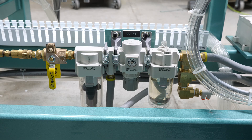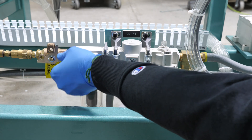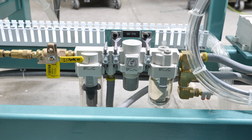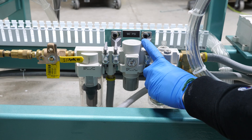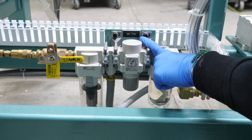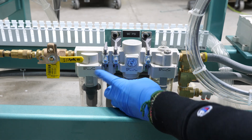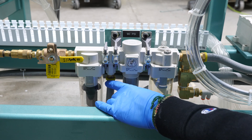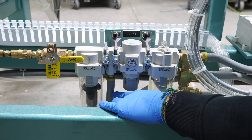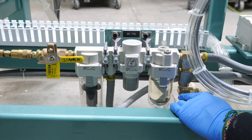When the machine is ready to operate, you will want to turn on your air at the air supply. After the air is on, you will want to make sure it is at the correct PSI of 90, which is shown here. The other components here are the filter to catch any debris in the incoming line. We have a dry line going to our dry components, and we have a lubricator for our lubricated components.